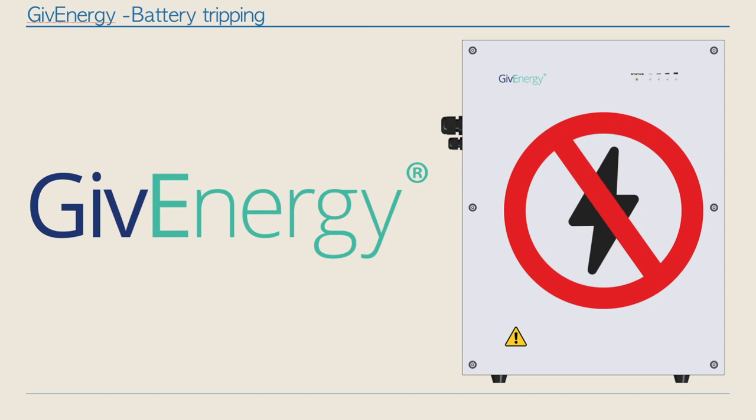The first thing to mention is that my GiveEnergy battery has been causing problems, getting progressively worse over the last few months. In the install, there is a GiveEnergy fuse positioned between the inverter and the battery. It's a 100-amp fuse and the battery draws about 63 amps max. But that fuse was tripping. It happened once in March — it took a few days to figure out — and after calling GiveEnergy they said it was most probably the fuse. Since then it became more and more frequent: once every couple of weeks, then weekly, then daily, and eventually a couple of times a day.